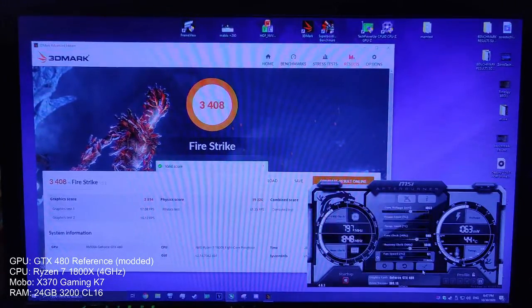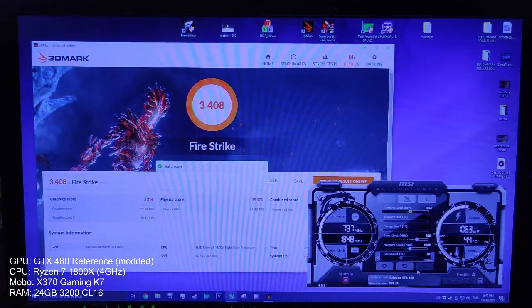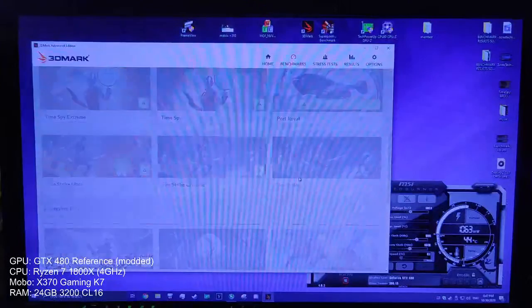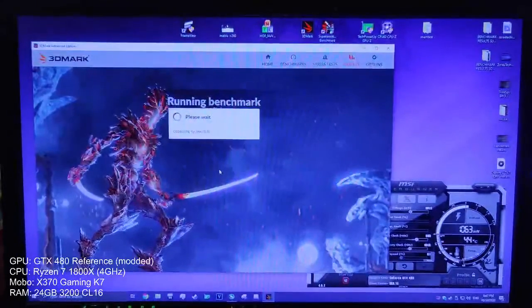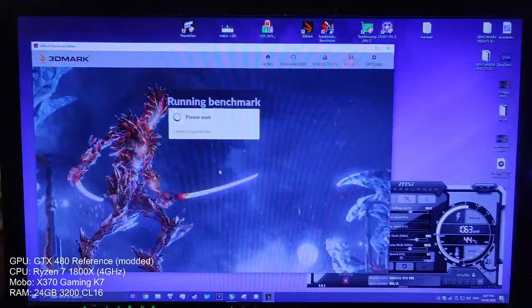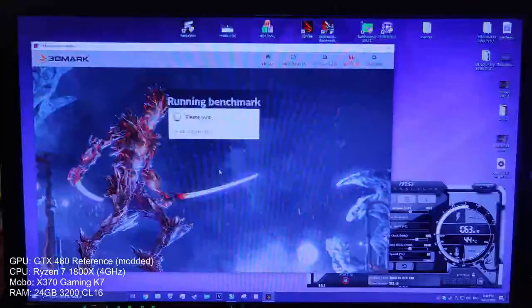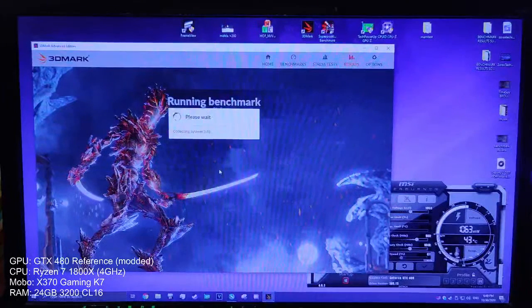Then we can go into the BIOS and set some things. I might actually remove the third memory stick because you can see there's 24 gigs. I do have 3 memory sticks because for video rendering I need all the RAM I can get. So I just use every stick I have, which is not great for performance because it's running 3200. All of it is CJR, which means if I just use 2 sticks, I can do 3600. With 3 sticks, 3200 is the best I got working.